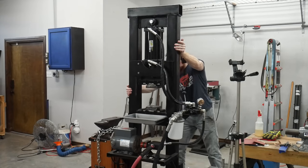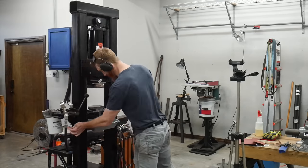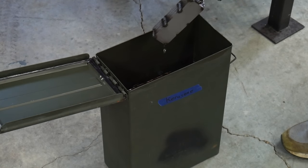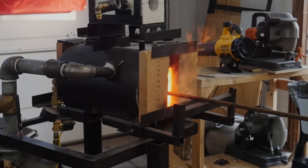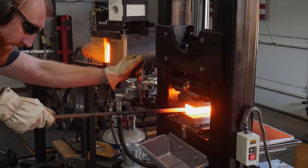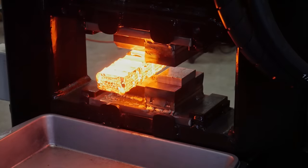To empty the pan I plan on using my shop vac. With this Damascus billet I plan on not using any borax as flux — I'll be relying solely on the reducing atmosphere in my forge and kerosene. I found this worked fairly well coupled with my steel prep cleaning process. The initial press is the most important since it sets the weld, so I lightly press the billet and quickly get it back into the forge.